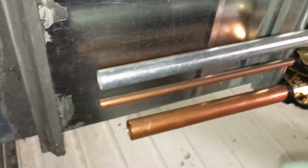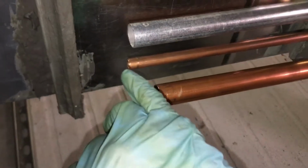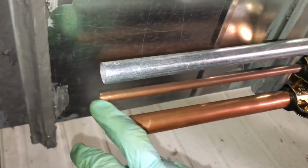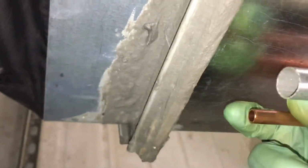You always want to confirm, because you could lose your nitrogen flow. You could barely feel it because as it goes down your Ys on your branches, it'll lower the flow of nitrogen. So do a fast purge first and then lower it down, and put either your lip or, like, your eye is very sensitive, your upper lip is very sensitive when it's sweaty. And you can barely feel when you have the flow all the way down on braze mode. You will actually feel very little flow.